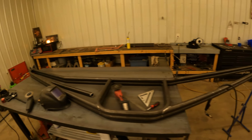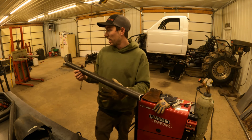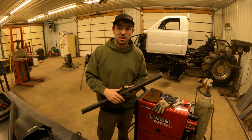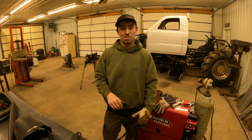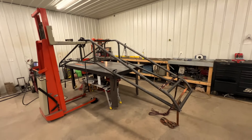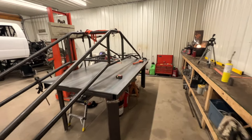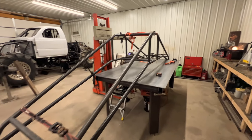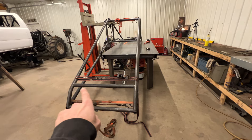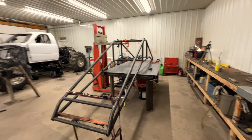All right, there she is. Now that I got that done, the next step — I got six of these cut, I'm going to do two in the front, two in the back, two in the middle, stand this thing up on the table, get it all squared up, get it tacked together. And then once the lower frame is put together, I'll put it on the floor, set the cab over it and start building my cage to the cab. I got everything ratchet strapped together — nothing's tacked in yet, none of these center bars yet. I took the orange square around and everything is pretty square, so I'm pretty happy with it. I'm going to start tacking these on the bottom and then squaring these ones up, then tack the other side and start to weld it out. She's looking good. Need a bigger table though.